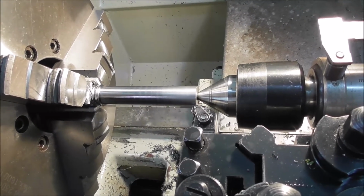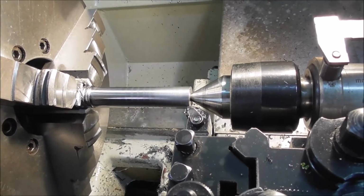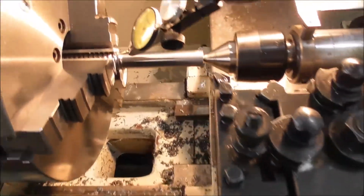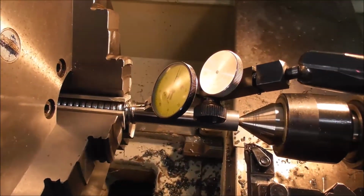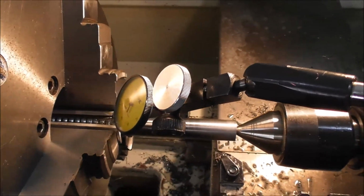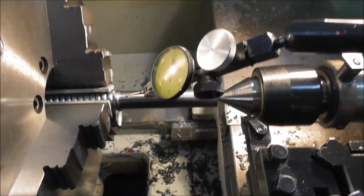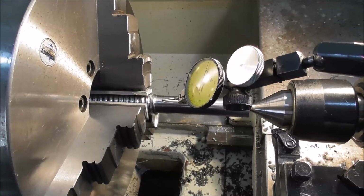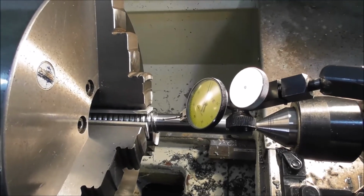I can just do it with tungsten carbide. Ceramic would be better. It's an intermittent cut when you're machining the thread and very quickly breaks away the edge, so it's a difficult job. And when the machining loads become heavier, you've got to think about the work shifting and losing the accuracy of position that you've carefully set. So you may have to reset the job after you've rough machined it. This can become very time-consuming work, and you want to think twice about doing this work as a contract machinist to a low fixed price, because there's all sorts of unpredictable difficulties like this.